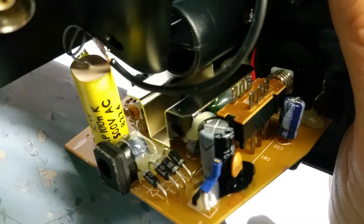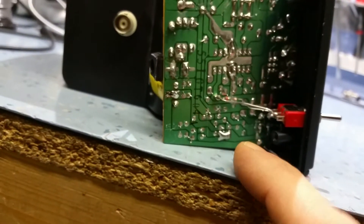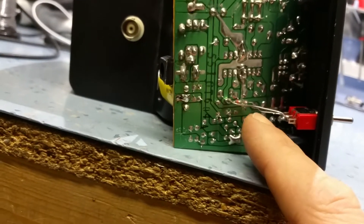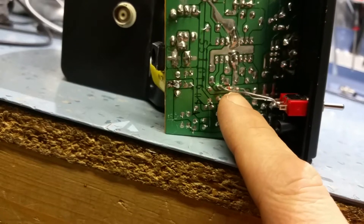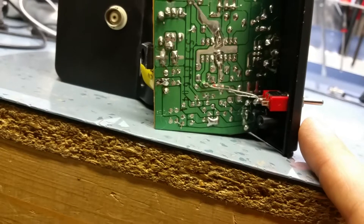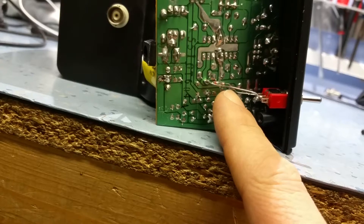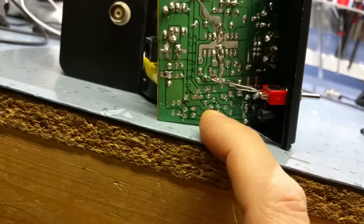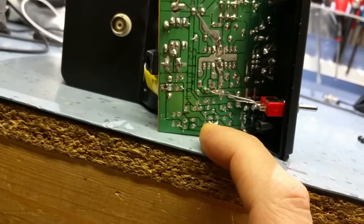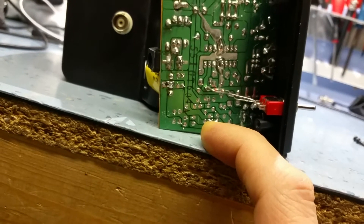You can see the little chip circuit there, the heat sink, and the power supply and rectification. That blue wire sticking up is the other channel — it's a stereo chip and I'm only using one of the amplifiers in it. Basically what I've done is put a diode detector in series with the input of the amplifier. So in one mode it will just be an audio tracer, and in the other position it opens the circuit to the diode, allowing current to pass through it and it becomes a detector.